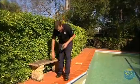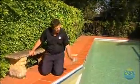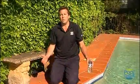After running your pump for ten minutes or so, that's the right time to take a water sample for testing. Take the sample from about thirty centimetres below the top of the pool level — turn the bottle upside down, down about thirty centimetres, and back up again. It's important to use a clean bottle or jar, because acids in an old soft drink bottle can affect the readings. Take the water sample to your local pool shop where they can test it properly and tell you what to add.